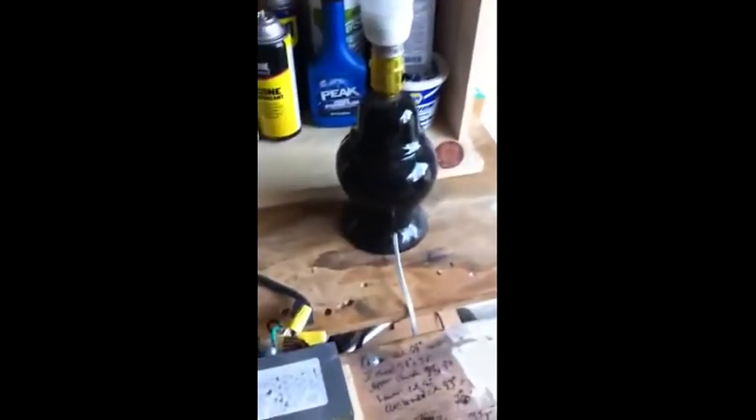The house circuits will be protected. I'll be using 1/16 inch 6013 welding rods from Harbor Freight — they were nice and cheap. These also act as a form of current control, because they're so thin and they're steel, so they have some resistance. They will control the current; they'll heat up a little bit, obviously, but you do want the welding rod to be fairly hot.